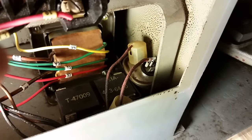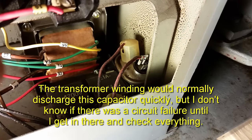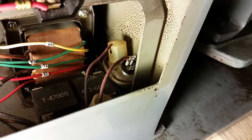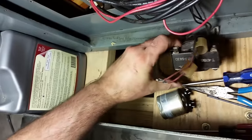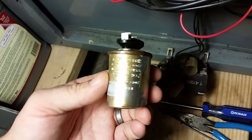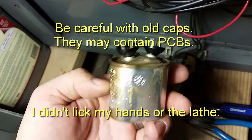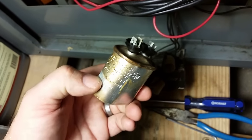Just a side note — this thing can hold quite a bit of voltage, so it will fry you. Of course right now it's exploded so it probably doesn't have the capacitance it used to, but it's still considered dangerous since the machine's only been off a few minutes. I'm going to have to discharge this thing just to make sure it's safe to handle. Got the transformer fished out, got the capacitor off. It's made in the USA — one microfarad, 660 volts, made by General Electric. Maybe I've got something like this laying around; if not, I don't think I'll get this project finished today.